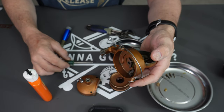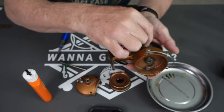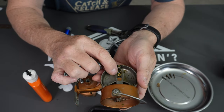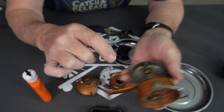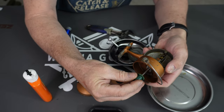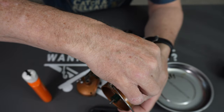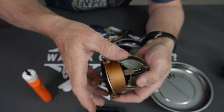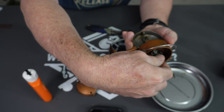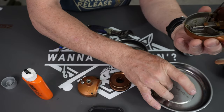Oil the shaft, grease the gears — that's how this works. The short one goes down in there — see how that little skateboard wheel just went right down in there. Then we put the shaft down in there, line the hole up, take the clean pin and put it through the hole — it goes into the skateboard wheel down in the groove. Then pull that up slightly.